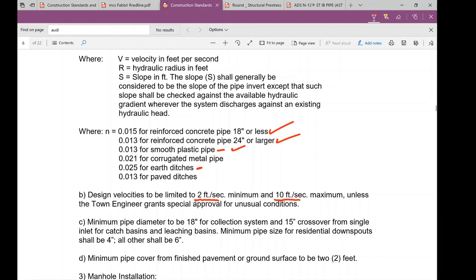After this, there are some YouTube video links on the PowerPoint. Watch them — they show the installation of HDPE pipe and concrete pipe. You'll see why HDPE is more popular: you're placing longer sections versus the shorter concrete pipe sections that take more effort. The last video shows how we install pipe using a pipe laser, a surveying tool used to align the pipe and keep it on the proper pitch throughout. Watch those and then we'll move on to the next topic.